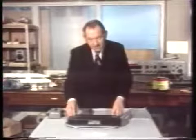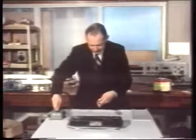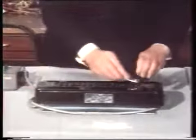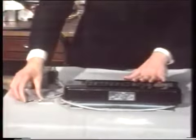Now, this is a row of electromagnets arranged deliberately to produce one of these travelling magnetic fields. So when I switch it on and put our copper cylinder over it, there you see the same effect, as if something was sweeping underneath it. When we put a bit of aluminium on, it does push it along, but not very fast. Let's try a bigger piece. That's better. Bigger still. Better still. You see, the bigger you go, the better it gets. This, of course, we call a linear motor.